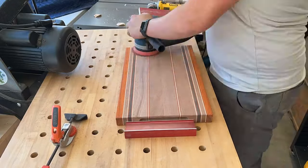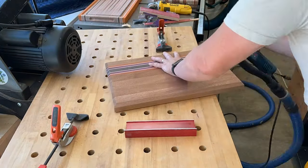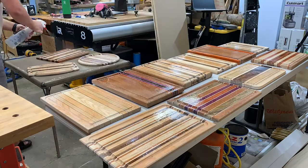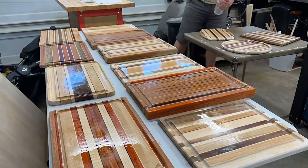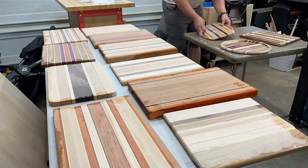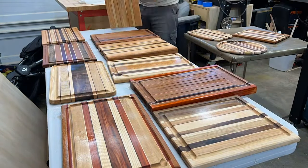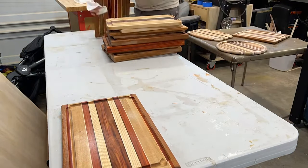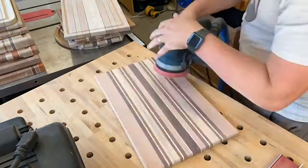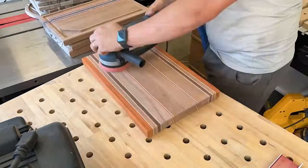Here I'm cleaning up those little grooves from the fluting and sanding everything up to 150. To raise the grain, I use a spray bottle with water and mist the surface of the board on both sides — you want water everywhere but don't soak it. Dry off any excess moisture. This raises the wood fibers so you can knock them down with 220 grit. If you skip this step, after the board gets washed it'll be rough to the touch.